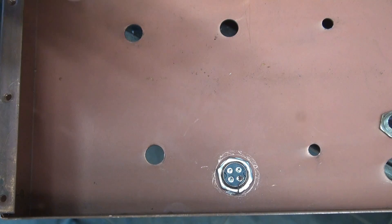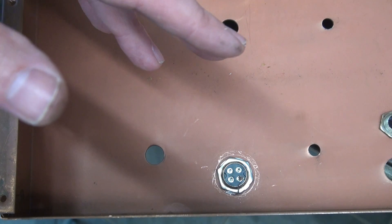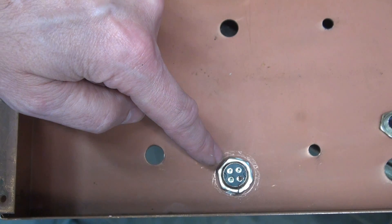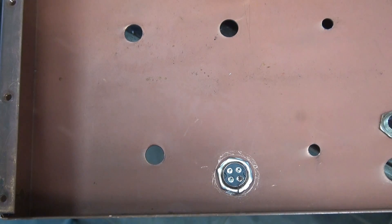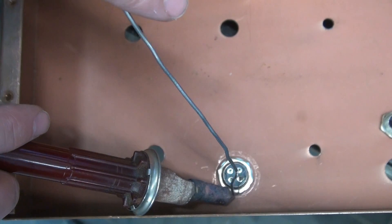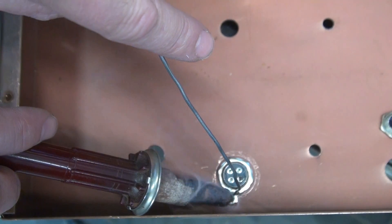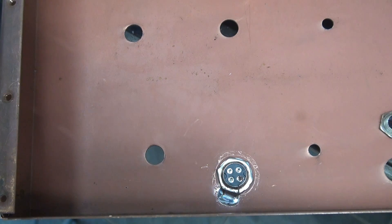You sure don't want to replace this mic jack twice because of what's involved to get that front panel off. So what is the weak link? That nut. Over time it's going to try to loosen up. The solution - we are going to solder that nut and the ground wire from pin two direct to the chassis. Problem solved.